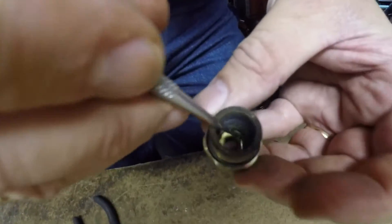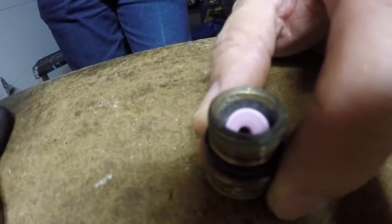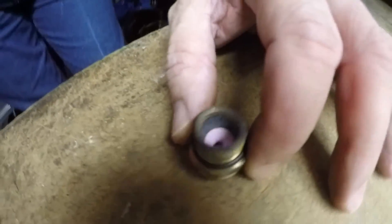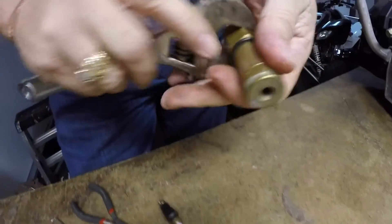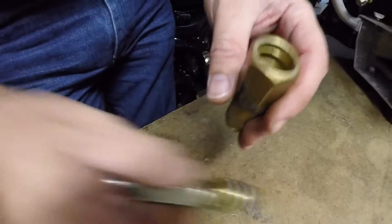There we go, seated in there. This cone needs to go with the beveled edge up. Set it inside, kind of drop it down, and make sure it drops all the way down into the o-ring. Sometimes I'll take the rotor head and push it down to seat the ceramic head piece into the o-ring. Now we can put it back together — put the forcing cone on, snug it up, it's got an o-ring seal. Drop the rotor assembly in and put on the base.